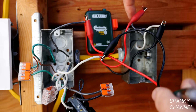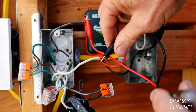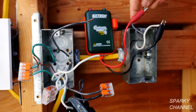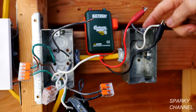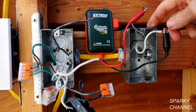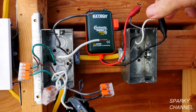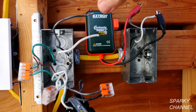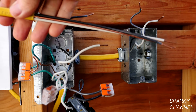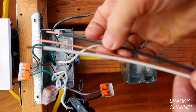So this black hot wire is that black hot wire, and this white neutral is that white neutral. Now we know that this box is upstream — one receptacle from this box. We see there's only one cable coming to this box, so we know this is the end of the run, meaning this has to be upstream. So what we're going to do now is change out this cable and put in a 12-2 with ground cable.